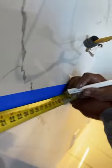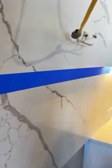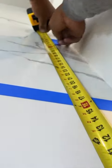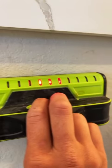First thing you're going to want to do if you do not want to use anchors is you're going to have to find the studs. Lay some blue tape down so your pencil marks are going to be more visible. Unfortunately the stud finder doesn't work here — the quartz is about an inch and a half thick plus a half inch of drywall, so it's not going to know exactly where the studs are. But an easy way to find the studs is to just look inside the cabinets and see where those mounting screws holding up the cabinets are.